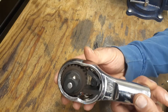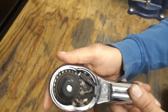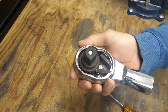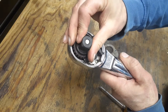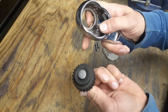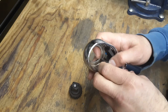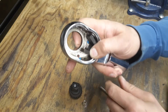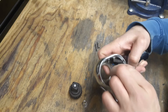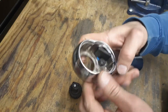Popping this apart, there's the inside of the ratchet, and there is no grease at all inside it. I'm going to add a little bit of grease. This looks very similar to all the other ratchets I've taken apart — the Craftsman ratchet, the Williams ratchet, and the Armstrong ratchet. Same type of deal on the inside. There are no seals on either side of the anvil. Here are the pawls, and there are some nice big springs in there.